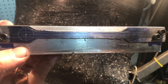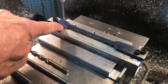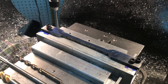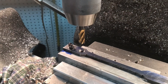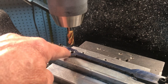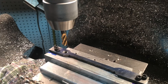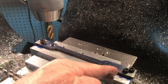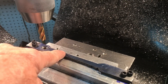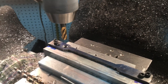Thanks to Mr. Kozo for suggesting how to do this. I'm going to start the next phase by drilling, reaming, and pin drilling the holes in the ends, and then do the milling to adjust the shape and thickness. After drilling and reaming a quarter-inch hole, I used a 3/8-inch end mill, 1/16th deep, for the pin drilling for the little washer that goes there. Using my DRO, which I've zeroed, I moved over to drill and ream the holes for the back. I've decided to make the left-hand one first, so that has the smaller hole in the front — I've got to remember to reverse that on the next one.